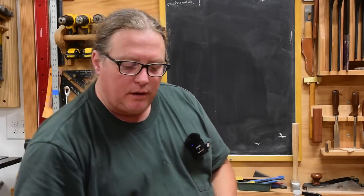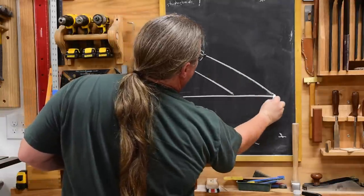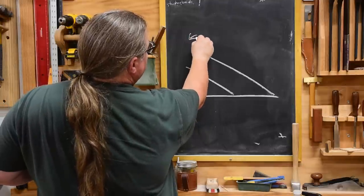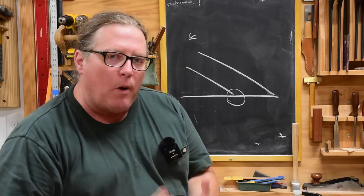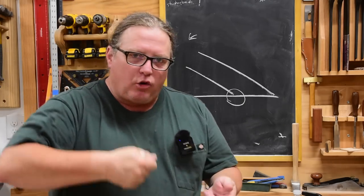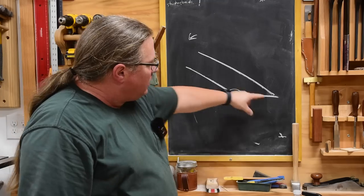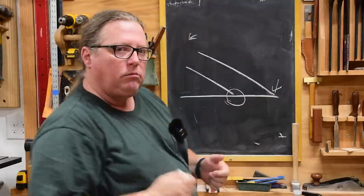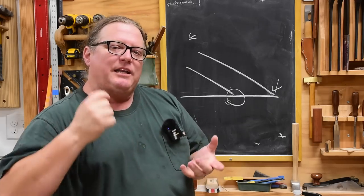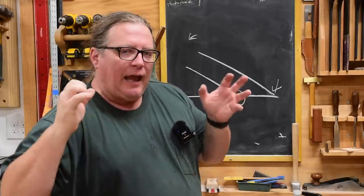What was happening is the bevel of my tool, I was rubbing it like I should. But if you think about it, you have your wood, the back of the chisel, the front of the chisel, working through the wood, and you're putting some downward pressure on this side. So it's rotating out. This becomes a pivot point right there, and that is a point the way most people sharpen their tools. So you can create a lot of pressure, even though it doesn't feel like much at your fingertips. You've got a lot of leverage, and it's using the wood itself to exert pressure right here. All that gets magnified, and you crush fibers in the wood. But it's so minute, you probably won't feel it, even though you've sanded the top, but they will absorb oil more. How do we get around that?